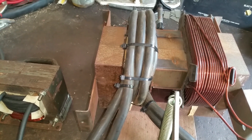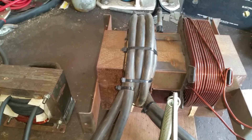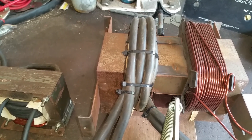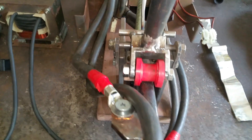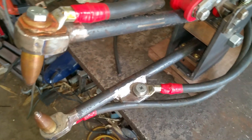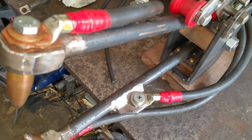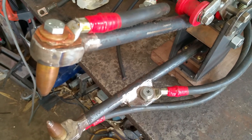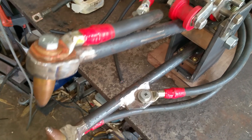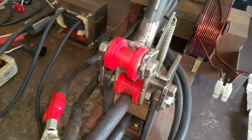After cutting out the aluminum stripping, I put two coils of 70mm square welding cable — each cable has over a thousand strands in it. Each coil is wrapped over the other so you have two cables leading out from each, and they're attached to the arms via various lugs. The actual handle and welding arms are 19mm steel bar — I would have liked copper but the price of copper is fairly phenomenal, so this will have to do. I've basically crimped up some cable ends and attached them via bolts.